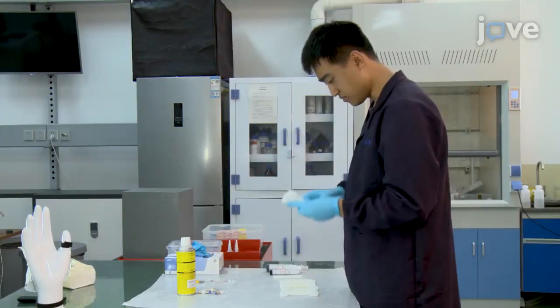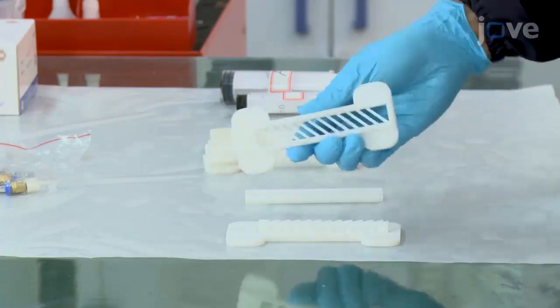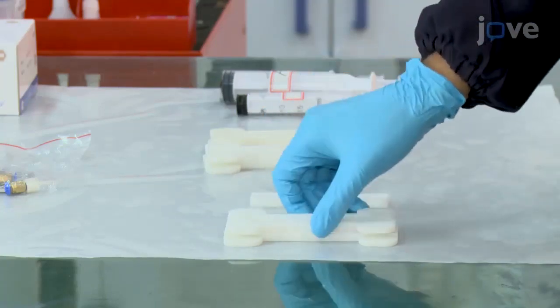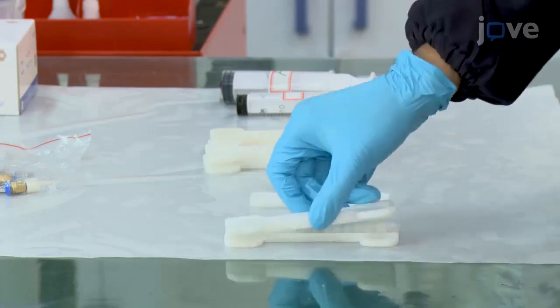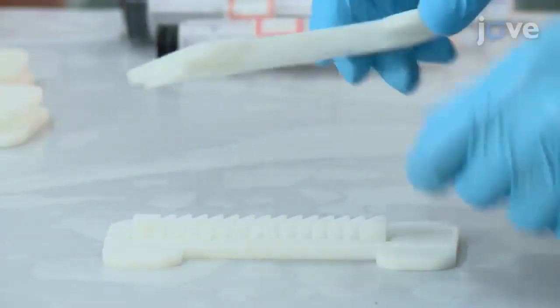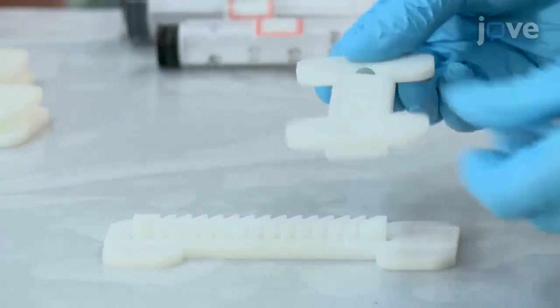The fabrication process requires molds. Design and 3D print a set of molds for the actuator with a 30-degree oblique chamber. Two parts will form the chamber mold, with one part having a hole to create a tubing connection. The third part will form a base.